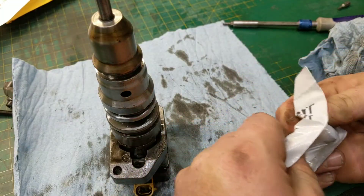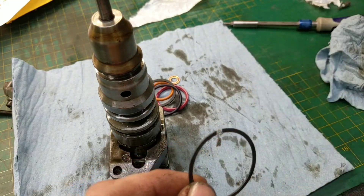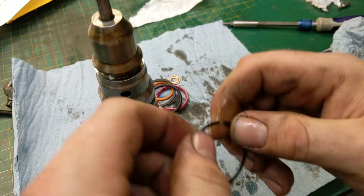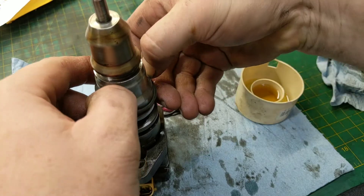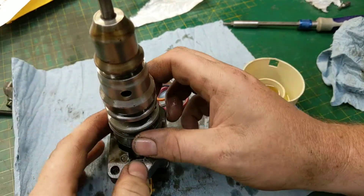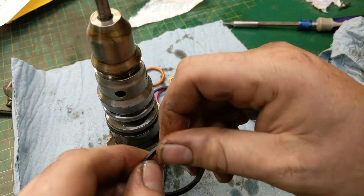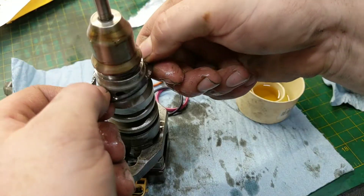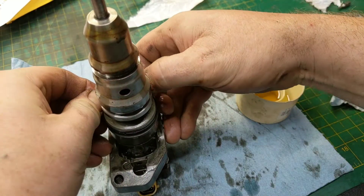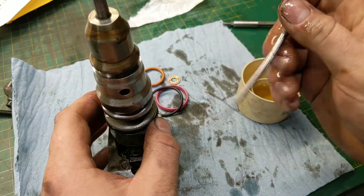The kit comes with a bunch of o-rings. The first thing to put on is the steel ring — take a little fresh oil and lube it up. Lube up every seal you put on to help it slide without tearing or scratching. Work the ring down — that's the first thing on, sitting at the bottom. Next is the square o-ring, basically a cushion. Get some oil, lube up the ring really well, and work it down. Be very careful not to tear it, roll it, or twist it. Make sure it's seated down against that metal ring.